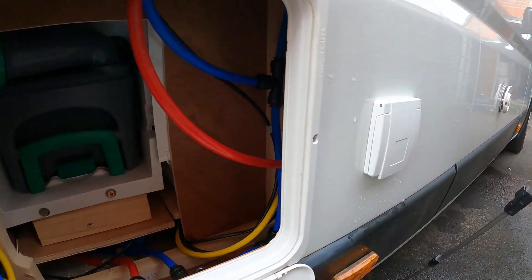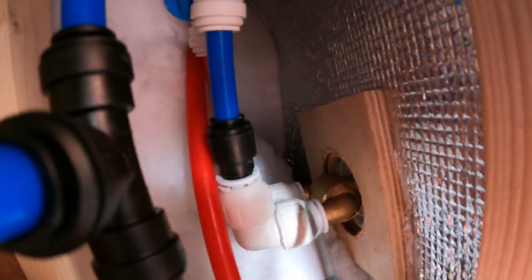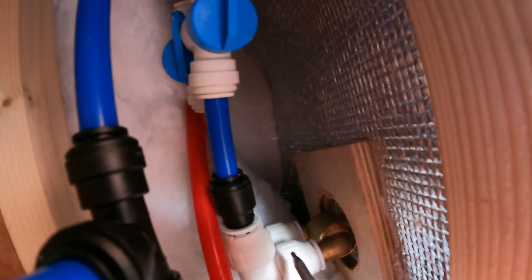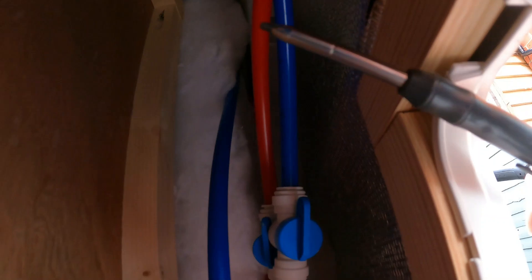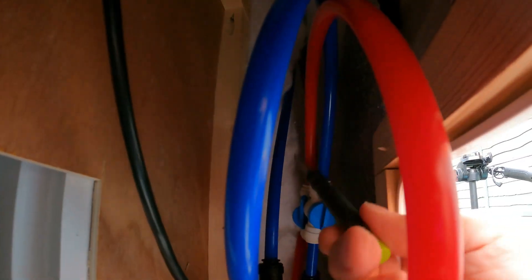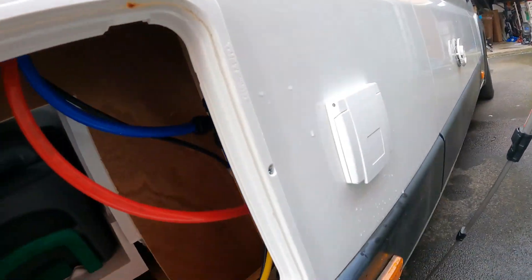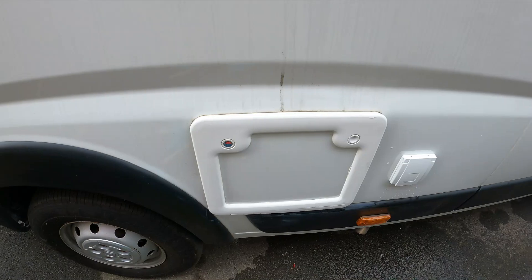Right, let me take you into the catacombs so to speak and show you how I've connected this up. You can see all my insulation up in there. That's the connectors off the back of the Bullfinch there. And then up above here we've got the isolators for that. Then the pipework basically just does a loop round here and then plumbs into the feed that's going to the shower. The cold one is the same - I've plumbed into the shower feed there, it comes off here, just does a loop round through there and into the Bullfinch. So that's actually working just fine. Once this is all put back together like so - that's what we've got. Marvellous.